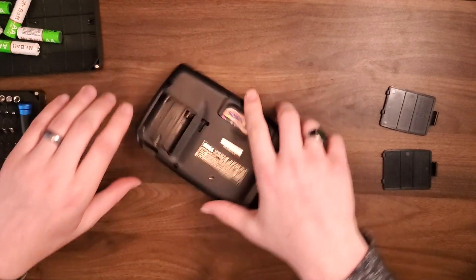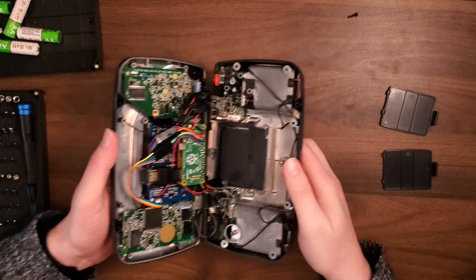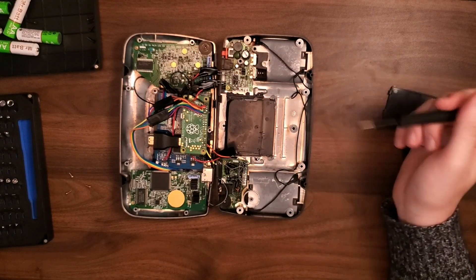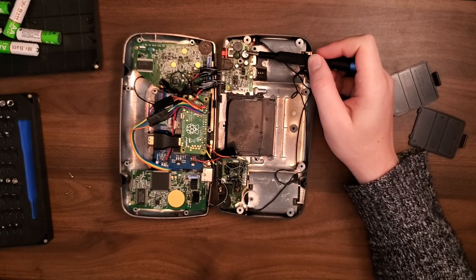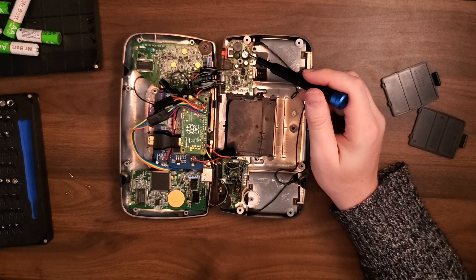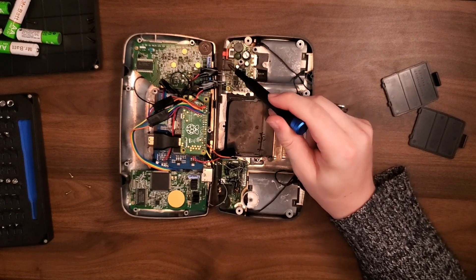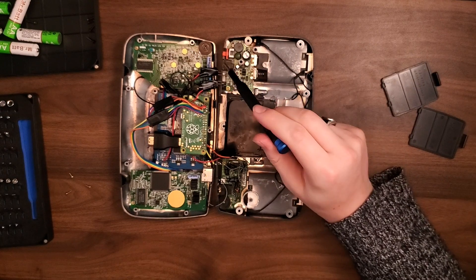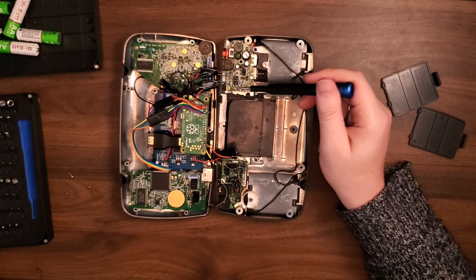I designed it to sort of hinge open — there we go. There's a fifth screw I had tucked in there. Working my way from the right side of the shell to the left: on the top here we have the power board. This is just the standard power board that is in any Sega Game Gear, which is great because that means it's an exchangeable part if something were to break. It operates off of the batteries, also works with the wall charger or car adapter. For power, we're simply stealing five volts off of the pins here and running them straight to the Pi and the screen.